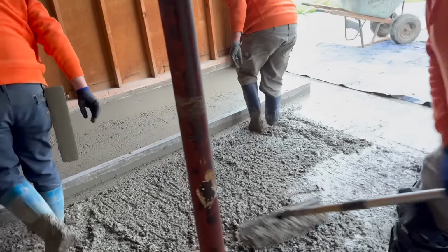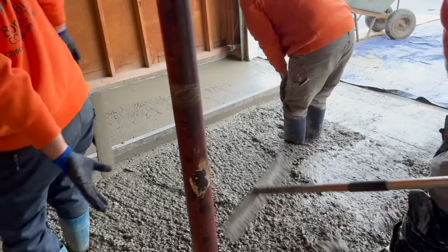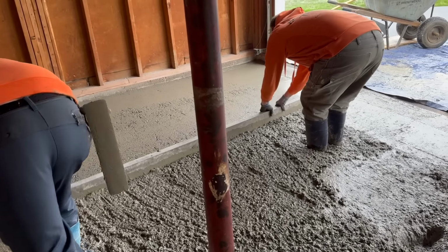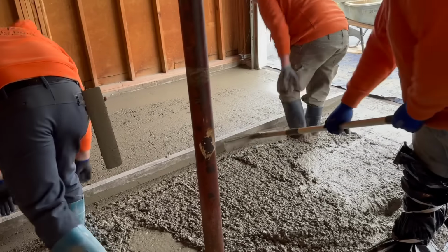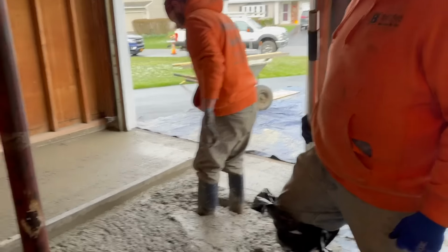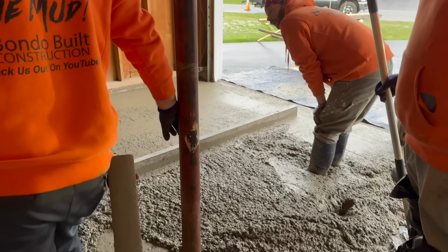It's not no 8 slump. This is about a nice 5. We like to pour a 5. Not the easiest to work with, but it gives you a really nice product when you're done. It doesn't soak into your boots as bad. That's true, yeah. If you had an 8 slump, man, you'd have concrete burns by now.